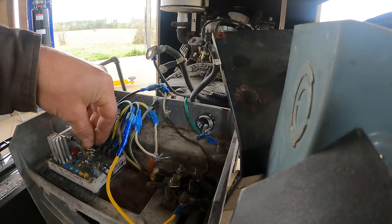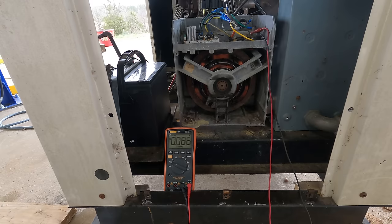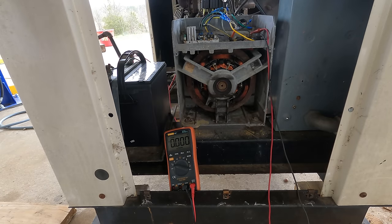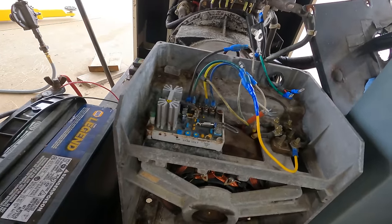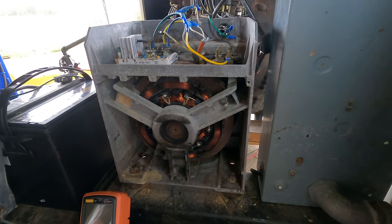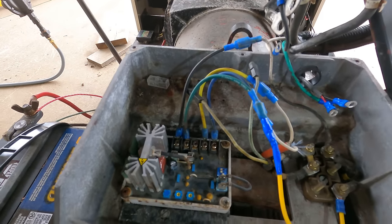All right, new fuse going in. Probably burn it right up, but let's see what happens. I saw a spark come flying out of that thing. Doesn't necessarily mean it's the problem, but I really tend to think it is. Yeah, and I just verified that fuse is also blown. Actually saw the sparks fly like from this side. Let me disconnect that AVR, get a closer look at it. Maybe that chewed wire fried something in that thing. It needs to be replaced.